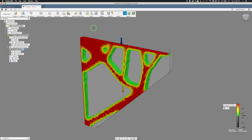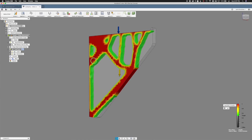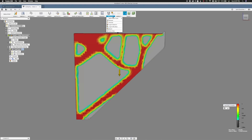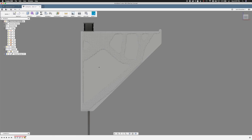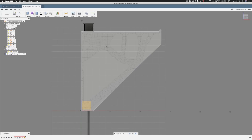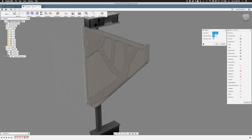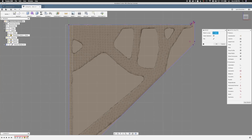Here's what you get back. What you're seeing in red is the load path criticality results — that's where we want structure to be, more or less. Next we want to go up to Results and Promote, then choose Model Workspace. That essentially takes that model and puts it into the model workspace so we can trace it with a sketch. First we want to get our old outline, so we're going to go to Project and click on the center of that piece to get the outline onto our new sketch.